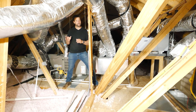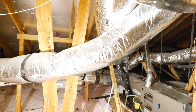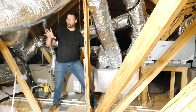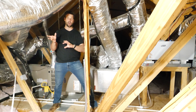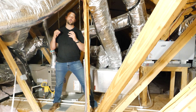However, rigid duct does have the secondary benefit that if you run rigid, you have to make sure that it fits through all of the holes that you cut for it — you can't cram it through something really small and pinch it off like you can with flex duct. Inversely though, if you run flex duct from the plenum all the way to your register in a direct home run, you don't have a lot of whys, branches, and seams that you have to mastic. So it all comes down to the installation quality.